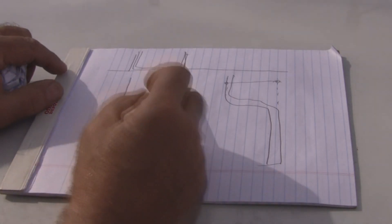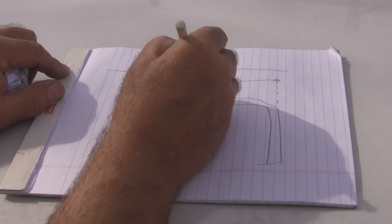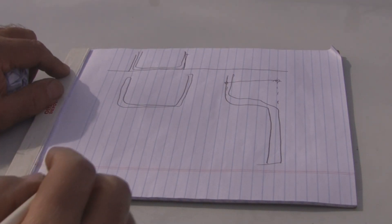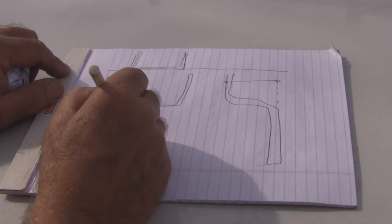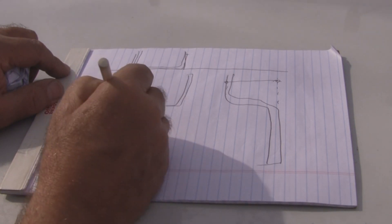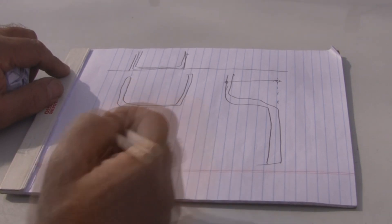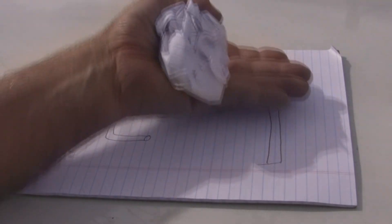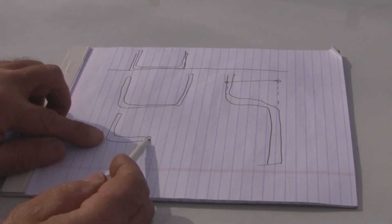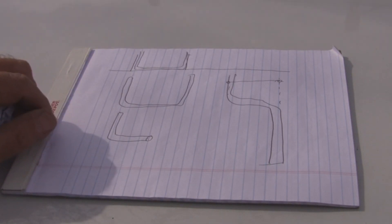There are videos on how to bend those. Now, there are two more ways this can go — you could be coming down with a piece of pipe and bend it towards you. You know, the U-shape and the S-shape are in a flat plane, but you could also come down here and have it come 90 degrees off the page or 90 degrees into the page. Those are all back-to-backs.